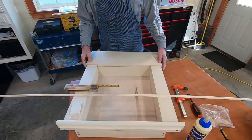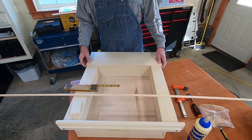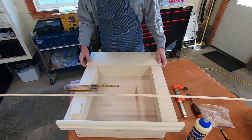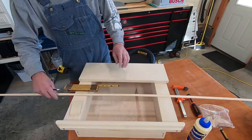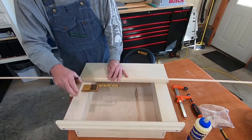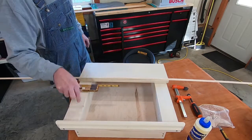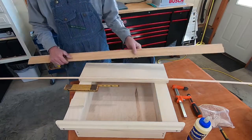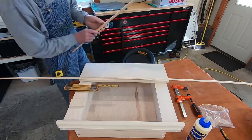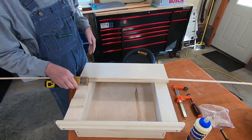So the top I've cut 3/8 on each side longer, so it steps out a little bit on the sides as well as the front. Then I'm going to leave an 1/8 inch below this half round, the thickness of this style exposed, then the crown. And I'll probably leave an inch or so there for piping. So let's go rip this down on the table saw.